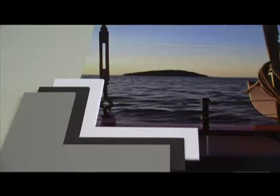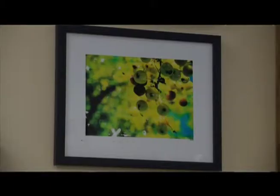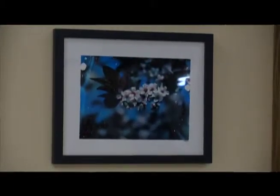There are a couple ways to keep the artwork from the glass. One is the matting — it produces about a sixteenth-inch air space. The second is to use an acrylic spacer which we put underneath the lip of the frame. That's invisible to the eye, but it does create an air space of about an eighth of an inch to keep the glass away from your artwork.